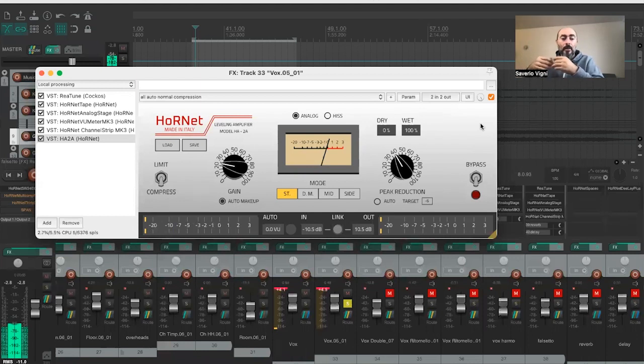As the frequencies get higher, you get a little bit more compression up until a certain point, where after 8 kHz, if I'm not mistaken, the filter starts to roll off again and you get less compression. So it's like having an oddly bell-shaped filter on the sidechain that compresses more in the range where the presence is, from 500 hertz up until 8 kilohertz, something like that. It starts to compress more, and then this filter changes drastically, and the compression is much less after 8 kilohertz.